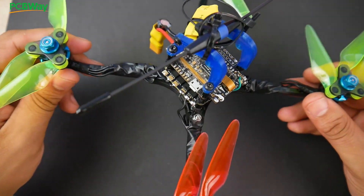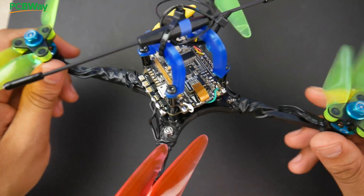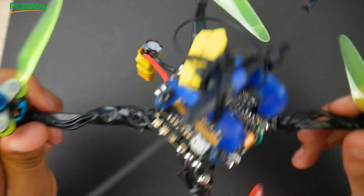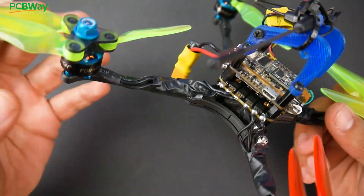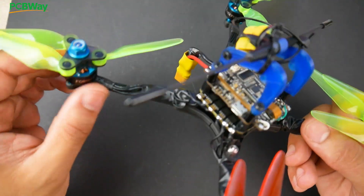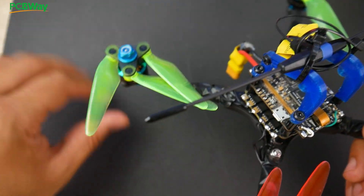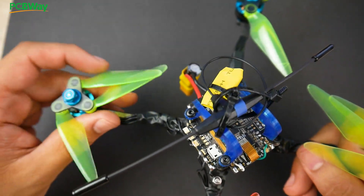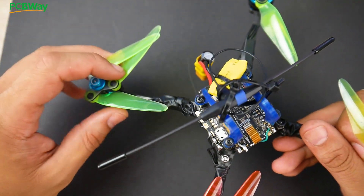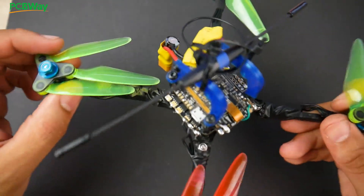Why would I do such a thing with 1408 motors? Well, this is so I don't kill myself — this is actually running the AI inside of it, and it's been flying really great. We do have our hiccups every now and then. This is an ultralight or featherlight build, and I'll have the frame link down below. I'm using 1408 2400kV HLRC motors. It's kind of like a 3-inch 6S setup. I wanted to make it reasonably weighted so I can test it in the shop, since I have to drive 15–20 minutes to go fly. This is just quick prototyping in the shop.